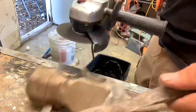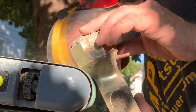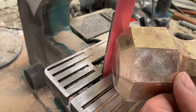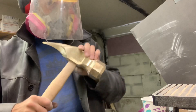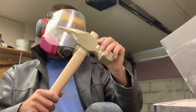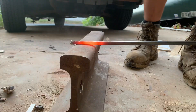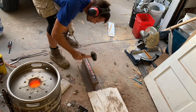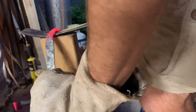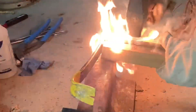Back to the sander — since I used it to make the original pattern, it fits perfectly and makes short work of the cleanup. The core worked but not perfectly; I still needed to do a little shaping to get things to fit up nice. I'm not a blacksmith and I don't have a forge, but I do have a furnace and that's basically the same thing. Most historical war hammers had a way to rivet the head to the handle — it wouldn't be good if your hammerhead flew off in the middle of battle. So instead of just using a wedge, I'm making a bracket that will allow me to really secure the hammerhead to the handle.